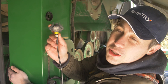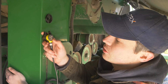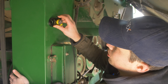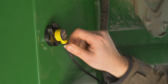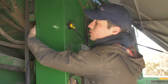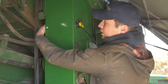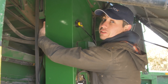When you're going to mount your sensors, make sure you choose the receiver sensor for the outside of the elevator. You'll be able to tell it's the receiver because it has a second LED and it has three wires on the connector. To clip it into place, compress the tab at the top and twist it into place — you'll know it's in when you feel a click. To mount the receiver sensor, you may need to peek around the back of the elevator to make sure the tabs are lined up with the mounting plate. Press the sensor in towards the mounting plate and twist clockwise — you'll feel it snap into place.